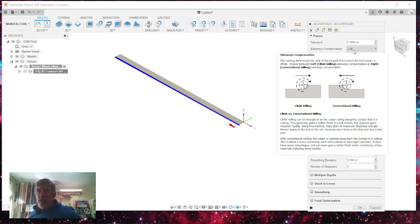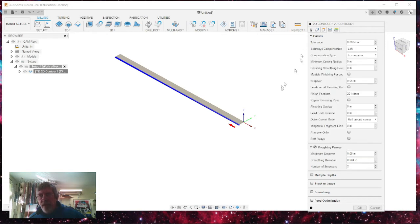The conventional mill works really good for some things, but because you're using wood, it works better if you're not trying to chip deep cuts in and coming out. It will chip away wood, especially when you're doing burls and woods that have grains that go in different directions. It's better if it's climbing in, cutting as the router bit is turning, scooping into the material, kind of like you would with a chisel. It just cuts a lot smoother and a lot better. So that's what I use,